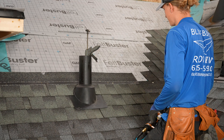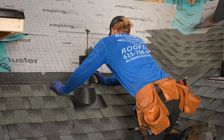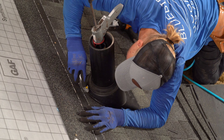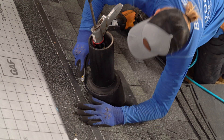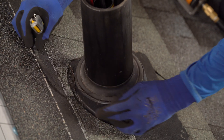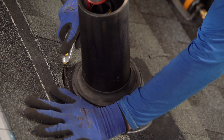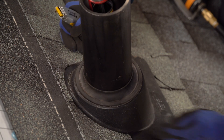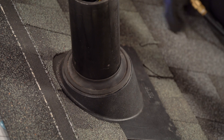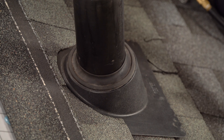After I get the final shingle on, I go back and make sure to trim enough of a rain channel on this edge. I'm a little bit tight there, so I'm going to open that up just a little bit more. Looking for a quarter to three-eighths of an inch — what I like to call that pinky spacing. Just like that. That acts as a ditch or a channel to suck in the water and draw it out so that it doesn't go underneath the shingle.